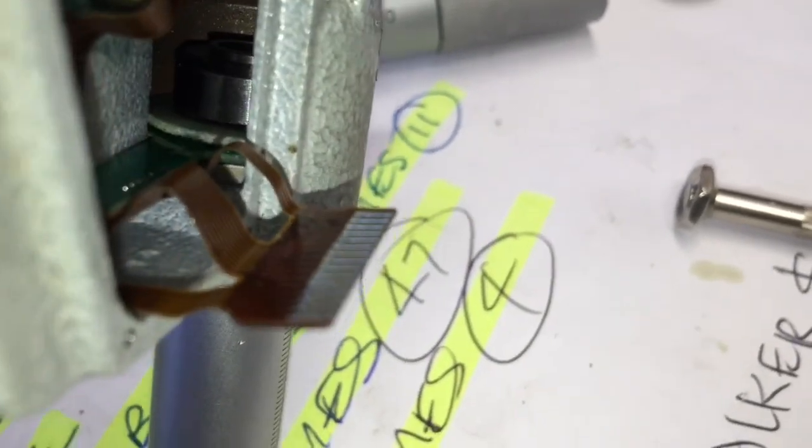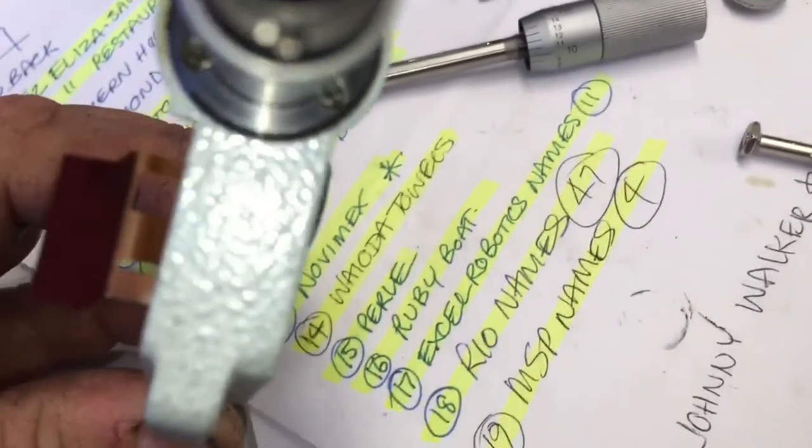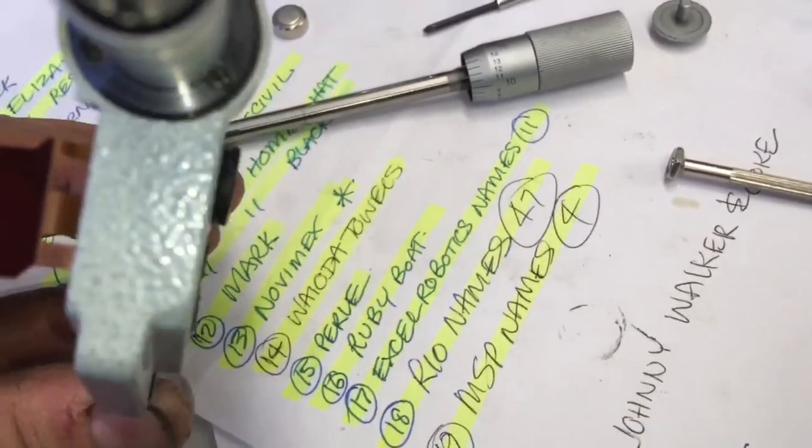Now, deep down in the guts, I'm just trying to turn the light. So deep down in the guts of this assembly, there is a little encoder disc, which when it rotates, gives an encoding to the electronics. There you can see the faceplate of the encoder disc, and the encoder wheel, which appears to be secured using those three Phillips screws.